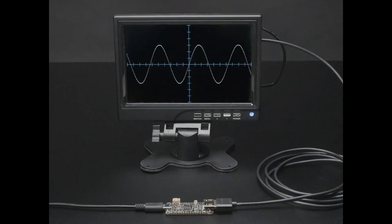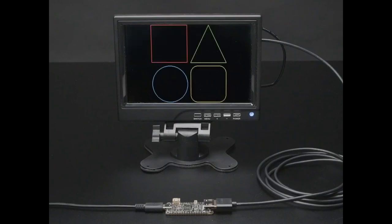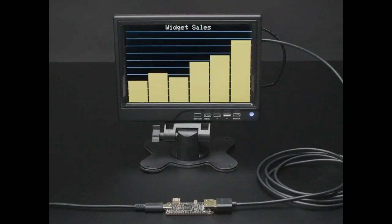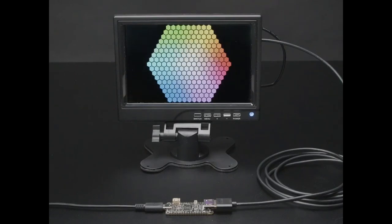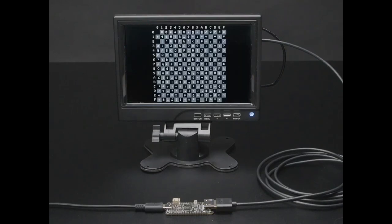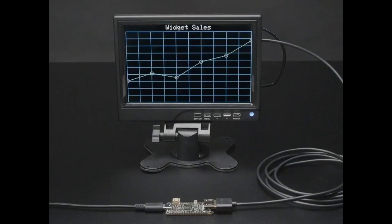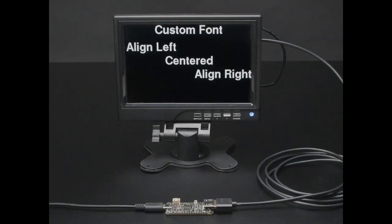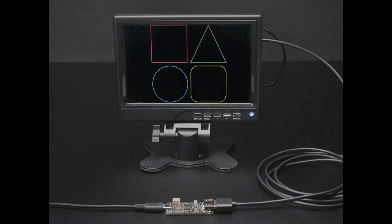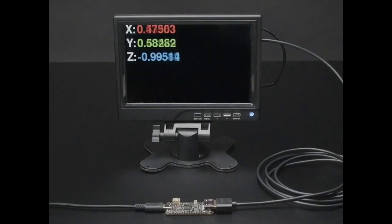If you want to have higher resolutions, I think Pico SDK can dynamically generate the signals faster, but then you have to be smart about drawing each scan line as it comes out. I recommend going with the Arduino library because it's simple. You don't have to race the H-Sync and V-Sync. You just draw it and it outputs in the background on the secondary core. But the trade-off is it uses a massive amount of resources.